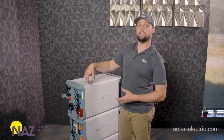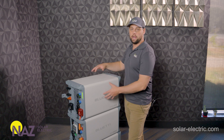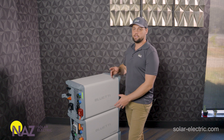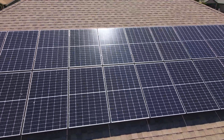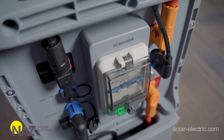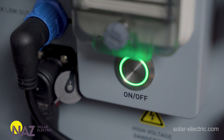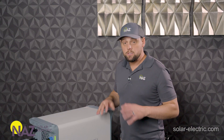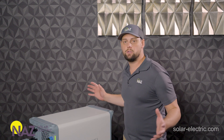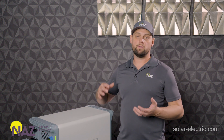The EP900 inverter platform has incorporated DC MPPT, so you can take a solar array and tie it directly into the inverter and manage all that solar power through this platform — storing energy from the solar array into the batteries. What's also very unique is it can be used with AC-coupled solar. If you have an existing solar array with a grid-tie inverter, you can incorporate this energy storage system with that AC-coupled solar array. It can utilize that solar power to charge the batteries, disconnect from the grid, and function as an independent energy storage system.